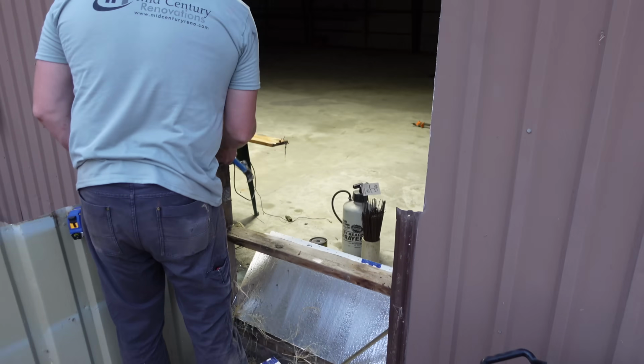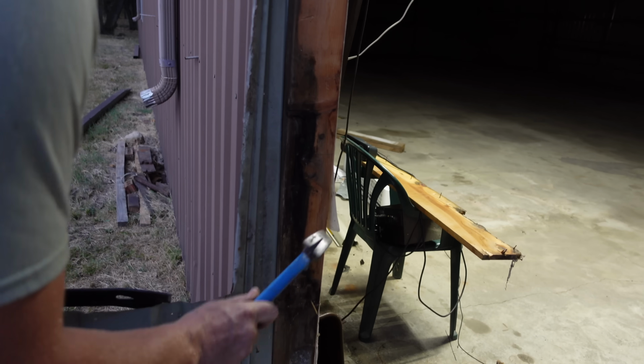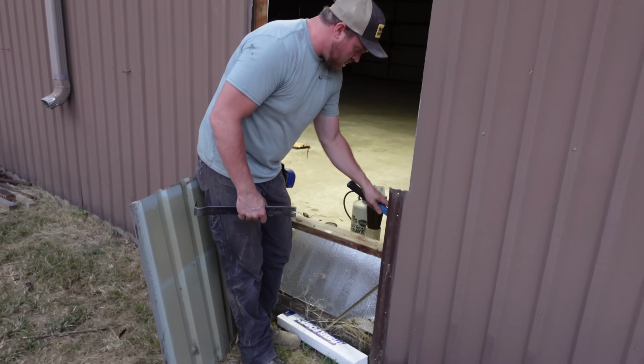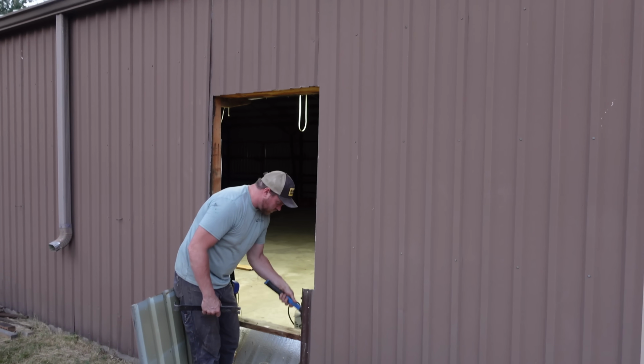The top board was rotten. So he is in here cleaning all this up. And I got all of our glass picked up here. But there's quite the mess from the years of water intrusion. Well, we've got a giant hole opened up here. We're gonna grab new 2x4s, scab them in to reframe this window, set our new windows in, nail them in, and put this all back together.